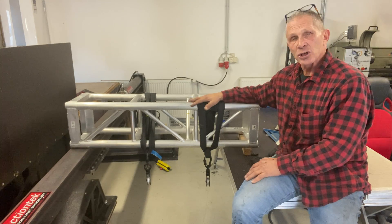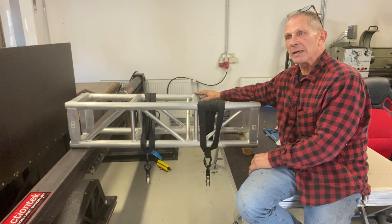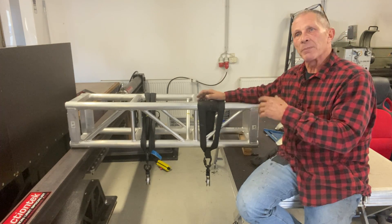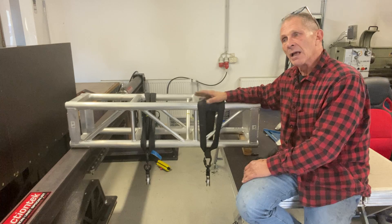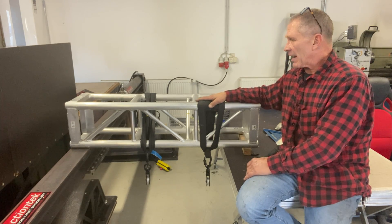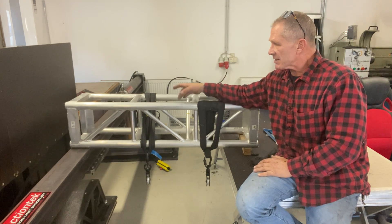I like to catch two cords on the truss. That's how most people fly trusses — either catching the bottom two and top two when they put them on a chain motor, or two span sets, one on each side to catch the chain motor. But they catch two points on the truss, top and bottom. That allows the whole truss to work as a structure together. You're not just pulling from a single tube.